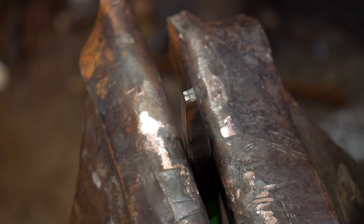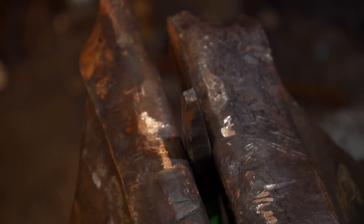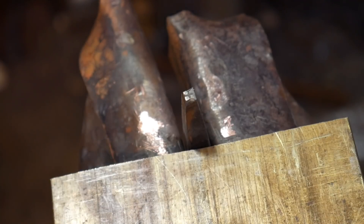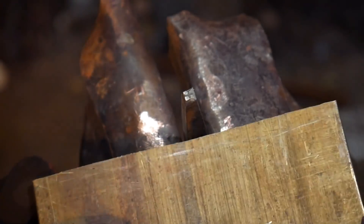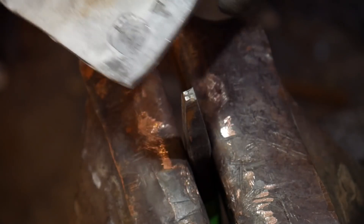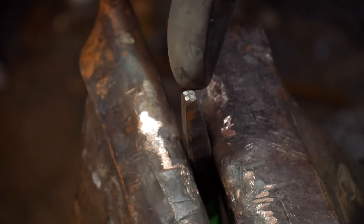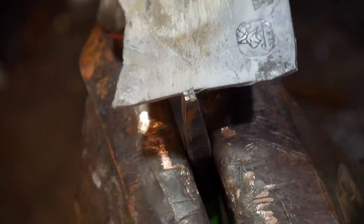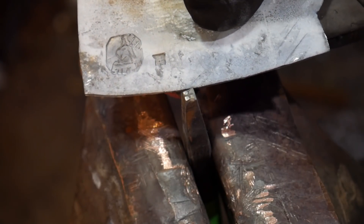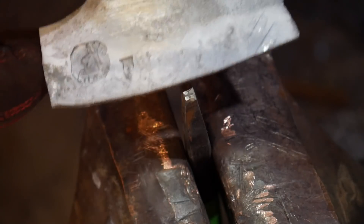The reason I wouldn't suggest doing that at first though — until you get your outlines — is I wouldn't suggest doing this until after you have done some sort of heat treatment to the material. Because if you've got something this small and you just go whacking into something hard right away, you're going to deform everything and not get a true accurate reading. So this is where the lead material is a little bit better to start with.